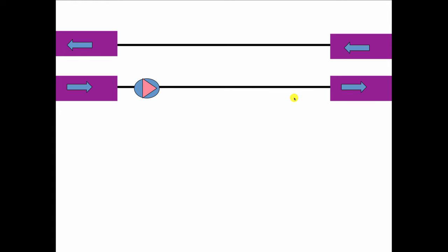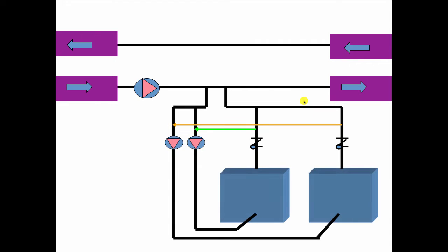I said to him, now what we're going to do is we're going to connect the two boilers. This is what I want your contractor to do. We're going to do something called primary-secondary pumping. So this is the primary pump, and that's going to come on whenever it gets below a certain temperature outside. We used a control from Tekmar to turn the system on when it got cold outside. It turns on the primary circulator. It's like a big merry-go-round. The water just keeps flowing around. We could do that because there's no check valves in this system.